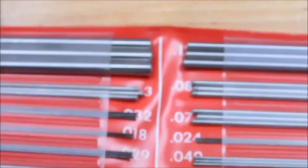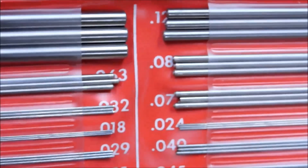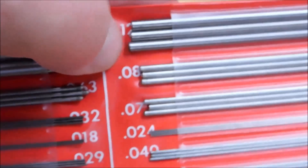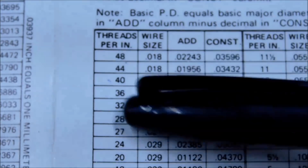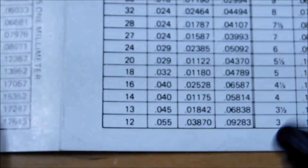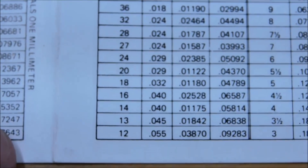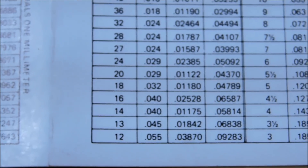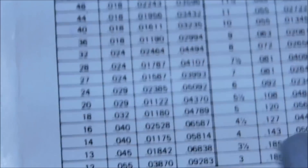Thread wires — easily acquired here in the USA. I know some of you in the UK and Australia have a hard time getting them; if you're willing to bite the bullet on postage, give me a shout and I'd be happy to send you some. Back to the chart that will be at the end of the video: we're at 12 threads per inch in the first column. The 55 value is the wire size, so we pull the 0.055 wires out of the kit. One value is the add value and one is the constant value.